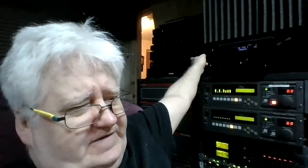Yeah, I have to set up a short lead, which is coming in. So I'll take the main lead, which is coming in from the Laserdisc player, connecting onto the AVR, and then connect that over to the Pioneer DVD recorder, and then the other lead from that back over to the AVR, so it's recording, and then I'm monitoring at the same time, because it's all got to be recorded in real time.